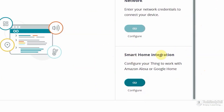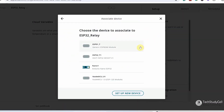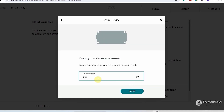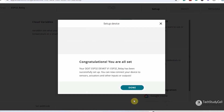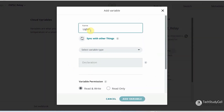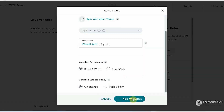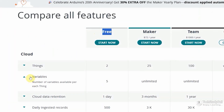After that, you have to add a device. If you want to use ESP32 or NodeMCU, you have to select that device and generate the secret key and device ID accordingly. Then you have to create the cloud variables. Here I will control four relays and one sensor, so with the first four cloud variables I will control four relays, and with the fifth cloud variable I will monitor the sensor reading. Under their free plan, you can create a maximum of five cloud variables.